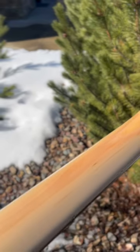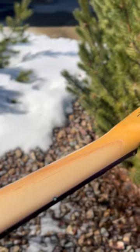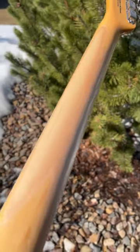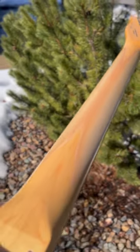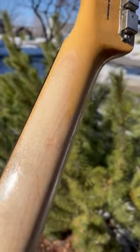I'm not sure if this is translating, but it's very, very smooth, even though it looks rough because it's taking that last finish off. Just going to let that dry with the tung oil, then I'll come back in, sand it down again with some quadruple aught steel wool, and let it do it one more time.